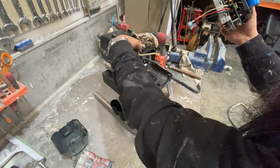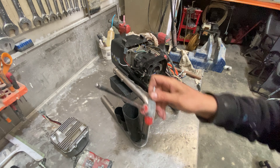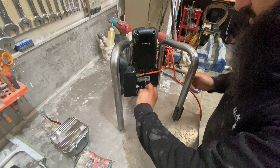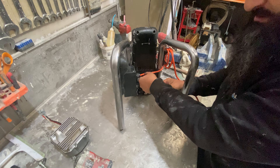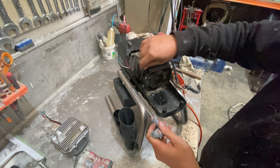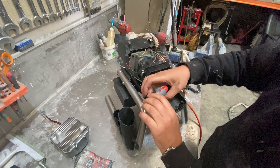We need to get three bolts off to be able to access the motor bolts on the lower shroud, and they are a 3/16ths Allen key. The first one is down there and that holds the electrical cable in place as well, so it's a double function. You have to do these ones with an Allen key because of the location — not many sockets can actually fit in there, so the Allen key works nicely.